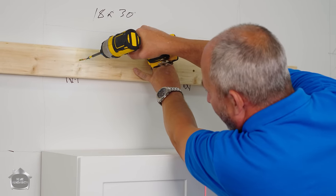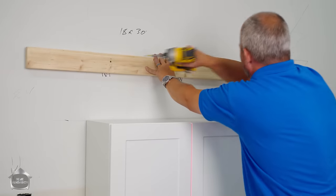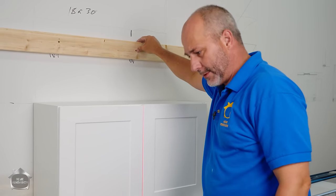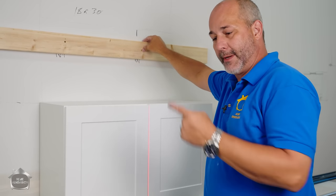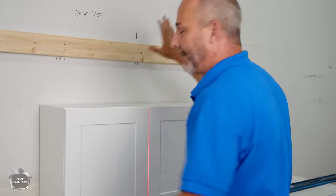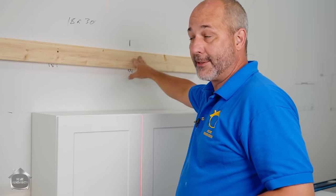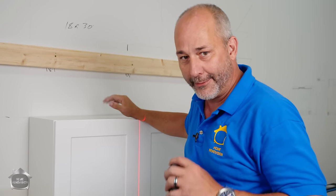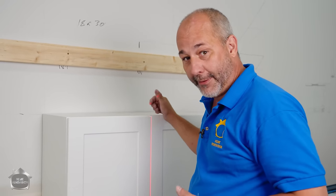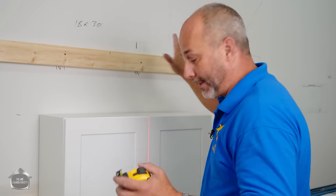Now I'm using a 3-inch screw. Which means I've got 1.5 inch material plus 1/2 inch drywall, this is 2 inches. Plus electrical code requires there be a plate unless the wire is more than 1.5 inches away from the surface. So I have 3.5 inches of clearance here, so I'm not worried about the screw. I'm screwing blind, but in this situation, I'm pretty confident we're not gonna run into a screwing through electrical. It's never a perfect world. If you're nervous about that, you can always cut away the drywall, look, and then put the drywall back. Okay, and then you can be more confident.